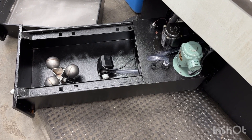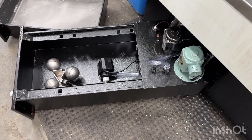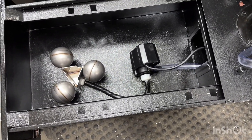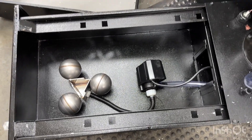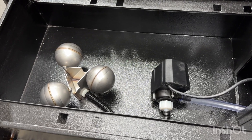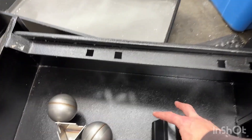The coolant system and chip management on this machine are pretty bad. I was using a bilge boom — something you put in the bilge of a boat to soak up oil, like a special plastic that absorbs oil but not water. That took up quite a bit of room in the tank, so I decided to upgrade to the next-gen see-through coalescer and installed it right into the tank.